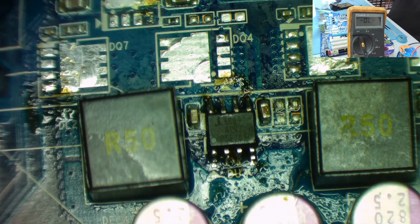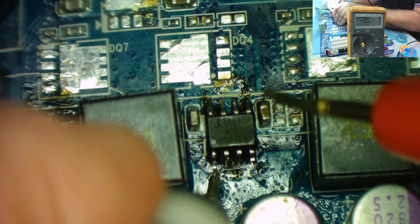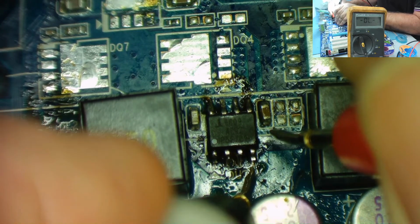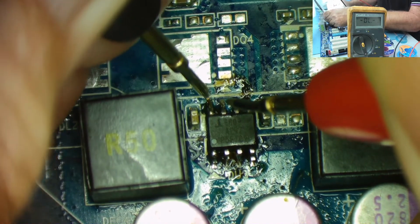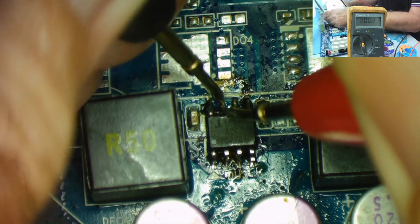And what I'm going to try and do is check from the pad. So I'm going to try and touch the pad, but not touch the chip, yeah. And then touch the pin. Yeah, that's connected. That's definitely connected. There's a big blob of solder down. Same as that one. This one, I'm against the solder, and I'm against the leg, yeah. So you see, I'm effectively trying to touch just where it comes on the pad. That's got quite a blob of solder on.